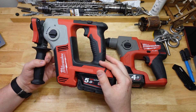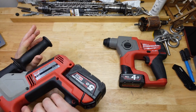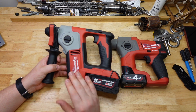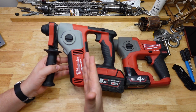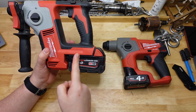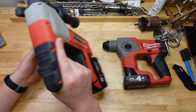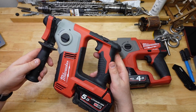Let's take a look at the 18 volt first. This is an older design — you can tell by the handle styling, and it is brushed, not fuel, as you can probably hear from the motor. This tool has been around since about 2012, and as a subcompact rotary hammer it's one of the first ones ever. It has a drop motor design, so the motor is here and your gearbox and hammer go up that way, which makes it nicely balanced with the battery on. The center of gravity works very well one-handed. It doesn't have vibration dampening but it doesn't really need it — it doesn't hit that hard — and you get a nice direction of force pressing straight through the drill bit.